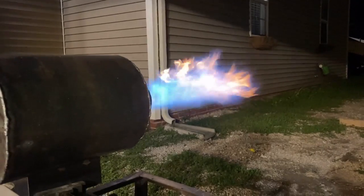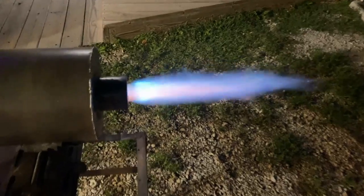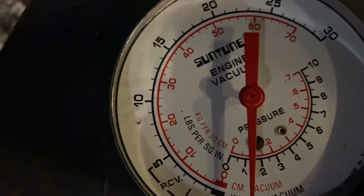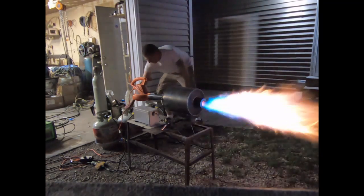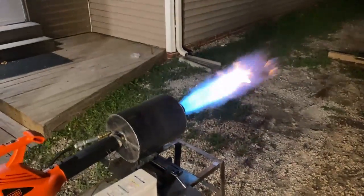I'm very impressed with the performance of this burner. One of the reasons I'm also testing the refractory-lined combustion can — I keep calling it a can liner, but it's actually the combustion can — is that this thing has to run forever. We can't be burning up stainless steel. I am going to buy some 310 stainless refractory to shroud some parts. My other goal tonight was to try and melt the 2400-degree refractory, but I didn't even come close — the internal temperatures just aren't significant enough.